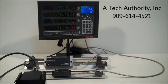upper right hand corner. Some of the features available: it's 2, 3, or 4 axis, including rotary and linear. Real-time toolpath graphics with auto zoom. It's got an ultra-wide viewing angle. Arc contouring calculates points along the arc for rough machining. Polar coordinate reading. Line hole routines calculate points along a line at equal distance. Programmable memory, teach mode, tool offsets, feed rate, linear and segmented error compensation.